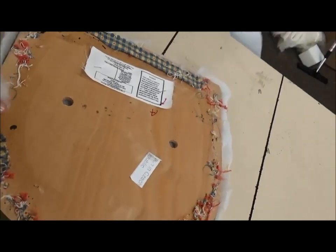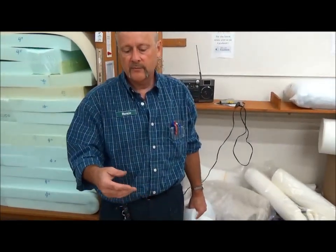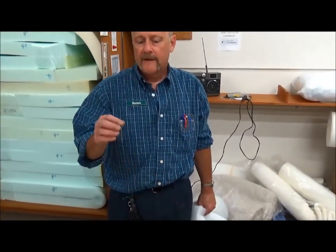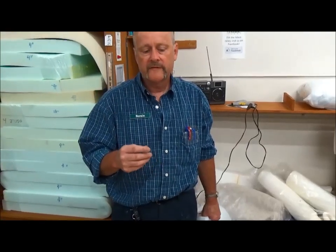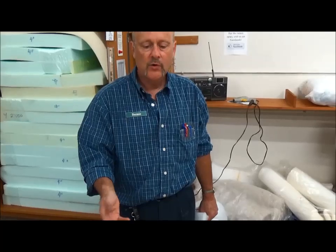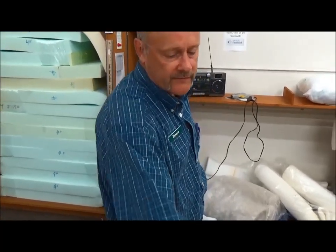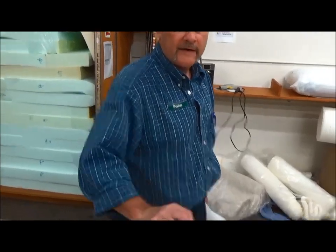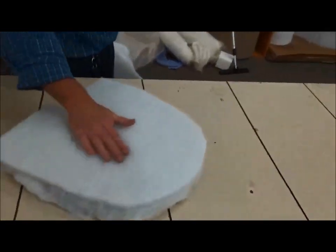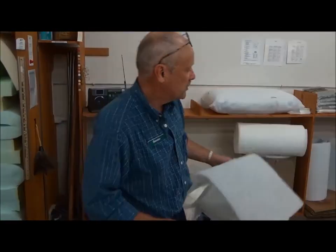So we've already done two things. We've unscrewed the slip seat. We brought it into here. Okay. Then we've stripped the fabric. Then thirdly, I believe, we've evaluated whether it needs new foam or not, or new stuffings of some sort. In this particular case, we added a little square of Dacron underneath the foam, and then another thin layer on the top, so we get a little bit of a crown. Looks a little more plush, a little bit more luxurious.